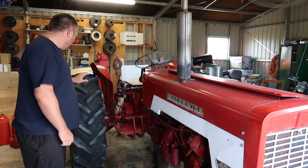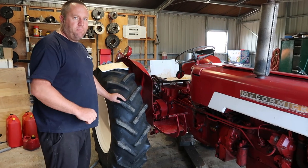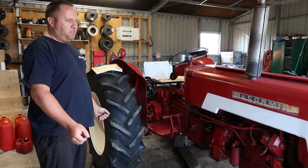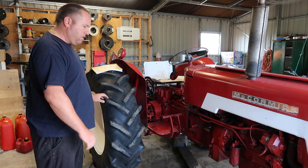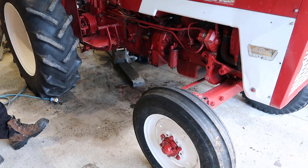Also, I'm going to fill these rear tyres up — about 70 to 80% full of water — to help pull the plough through the dirt. You should actually see quite a big improvement. You can move quite faster but you've got very little torque on the ground. These should be about 30 to 35 PSI when filled with water.